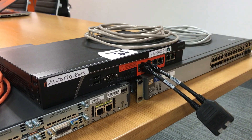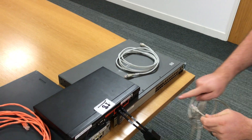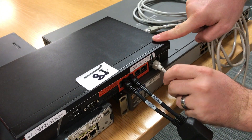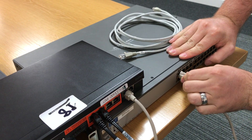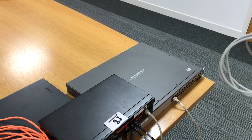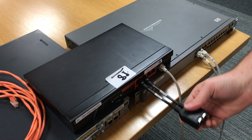On your LAN side, you're going to want to connect first your straight-through cable from your primary port onto a switch on your LAN side. Then connect the secondary straight-through cable from your switch, again on your LAN side, onto the LAN port of your power over ethernet adapter.